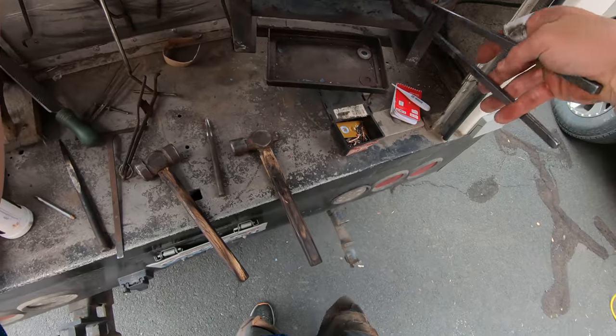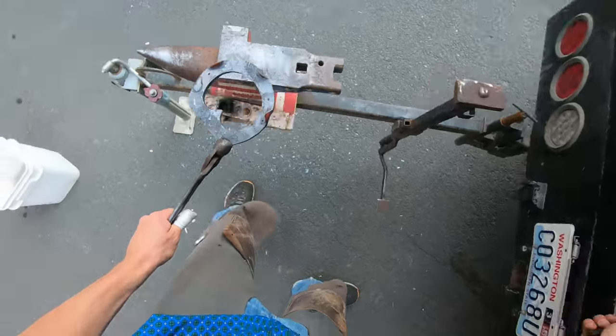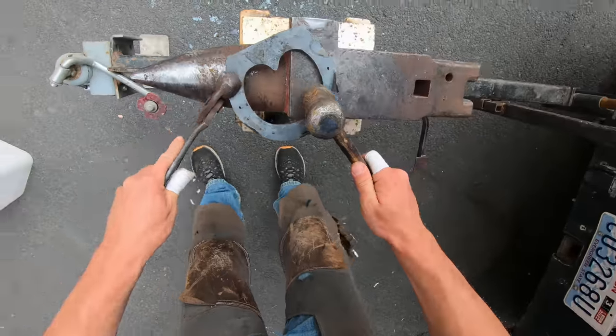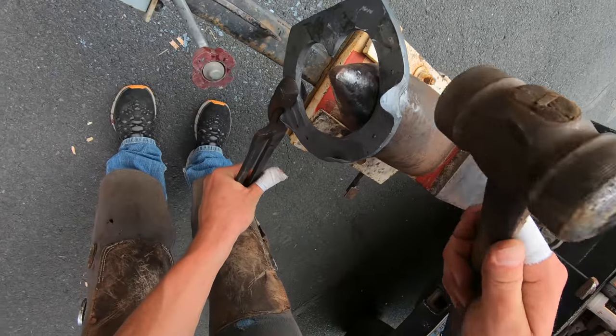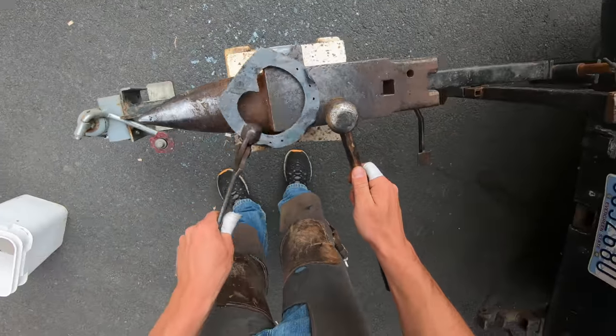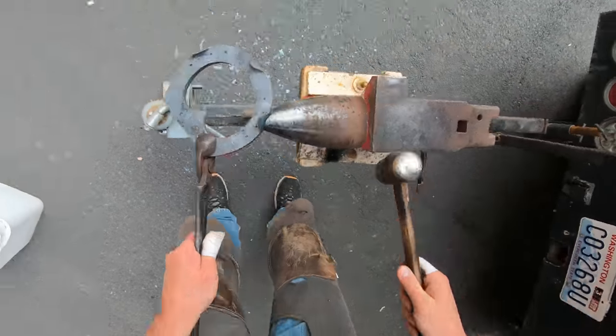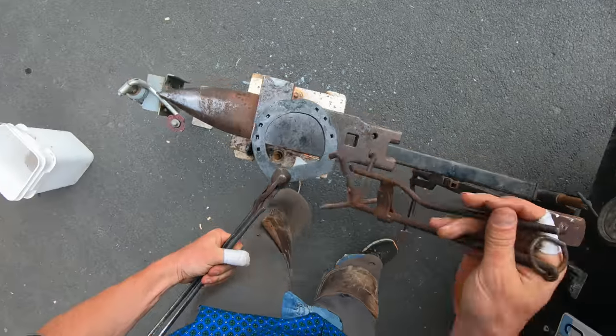The clips needed to come in a little bit on my shoe. Other than that, it fit pretty good. So I'll get those fixed and then go for a final burn. The biggest reason we're burning these shoes on is to give those clips a little pocket to sit in, which is going to really give them a lot of strength in holding that hoof capsule.